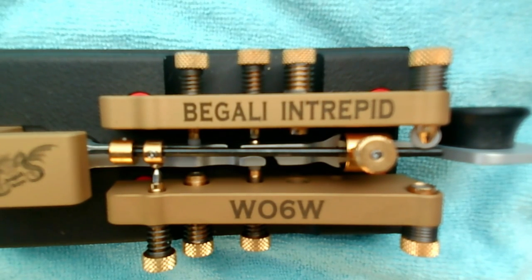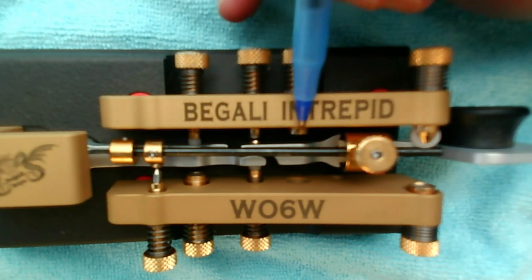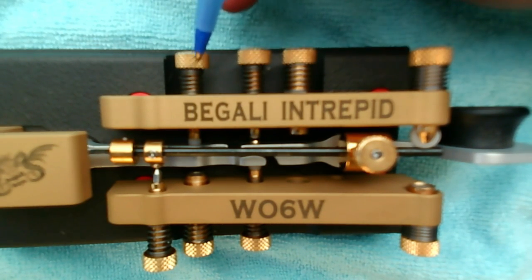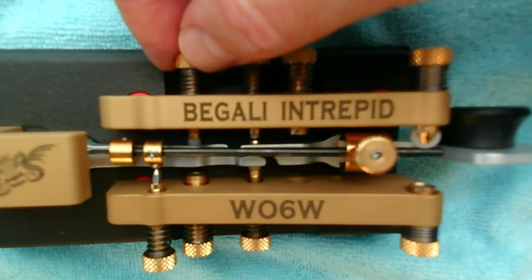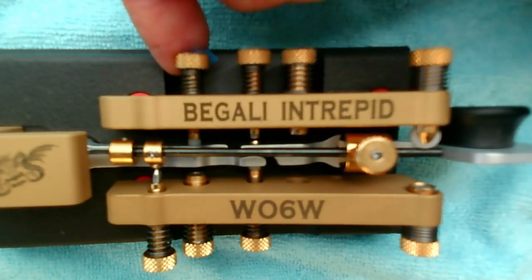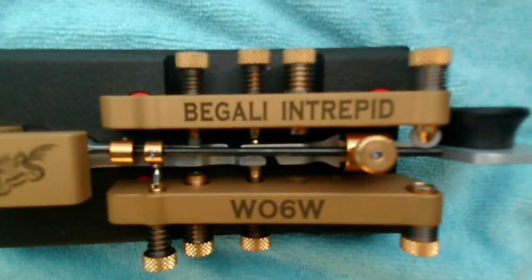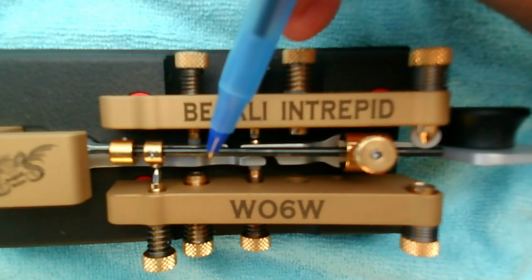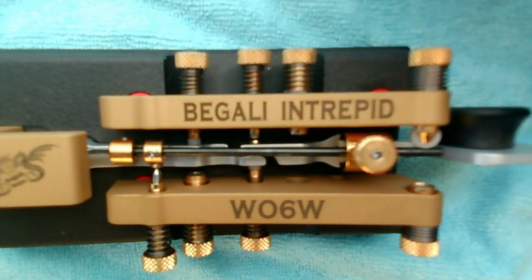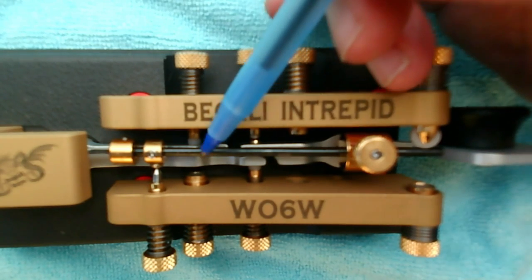We'll begin by centering the primary and dot rider arms between the two walls of the bug. You can see that these silver arms are running parallel between the walls. Control R1 sets that center rest position — if I bring the control in just a bit, you'll see the arms pushed out of parallel; if I come back out again, they return to parallel. One check to make at this point is to confirm the dot rider arm is resting on the dot rider arm stop. When I do dashes, the dot rider arm should stay fixed while the primary dash arm moves away, confirming the rider arm is resting on the rider arm stop.